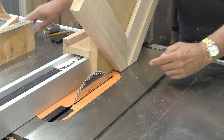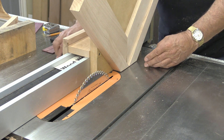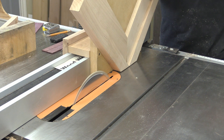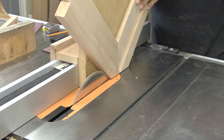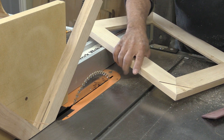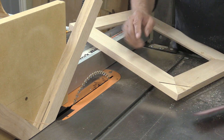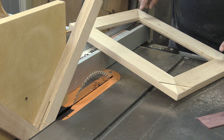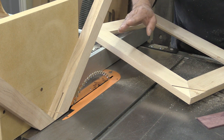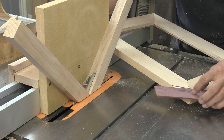I've changed blades and adjusted the height so it's just a little bit below what my blank is going to be, so I'm all ready to go ahead and make my first cut. That made a nice cut but it's a little bit shallow — I thought it would be, because I can easily butt into that. What I'm going to do is cut all the sides exactly the same, then readjust the fence to get a little bit deeper cut. Now that you understand the process, I'll just keep making multiple cuts until I get this right.